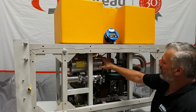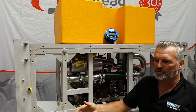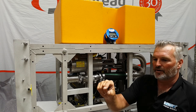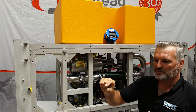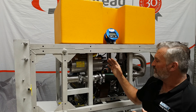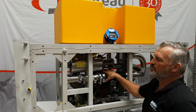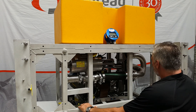We've also got a pressure relief valve here, which is not standard kit on competitors' units. This is suction relief and pressure relief as standard. On the safety side — asset safety — the topside computer allows you to set a warning, say at 1.8 bar if your install pressure is 2 bar. You can also put in another setting on the topside: don't want to exceed 2 bar. That's going to be an electronically controlled shutdown. As soon as you hit 2 bar, these relief valves will open, but it also sees 2 bar and shuts the hydraulics off to the water pump — the water pump stops altogether. There's no way of exceeding the given pressure for the product.